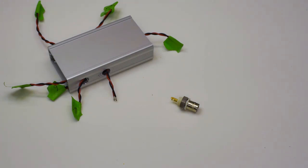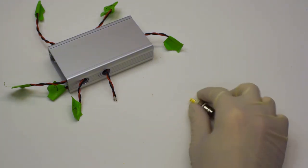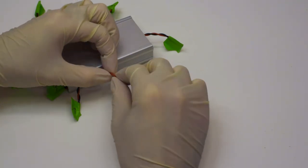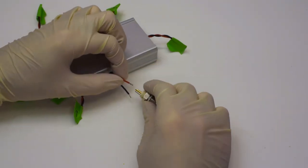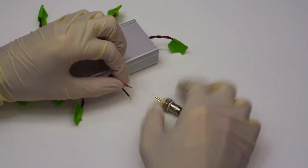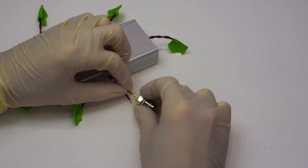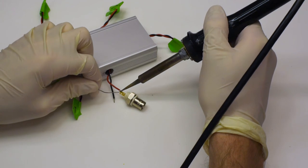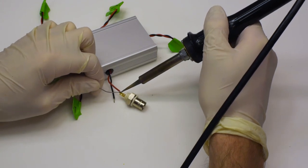This is an example of how we solder this. The procedure is really the exact same as with the strip board, just that it might take a bit longer to heat the ends of the BNC connector up simply because they're more massive than the limited amount of metal which you have on the strip board. You just shove them back in, they have nice and handy holes which hold them into place, and you heat everything up with your soldering tool.